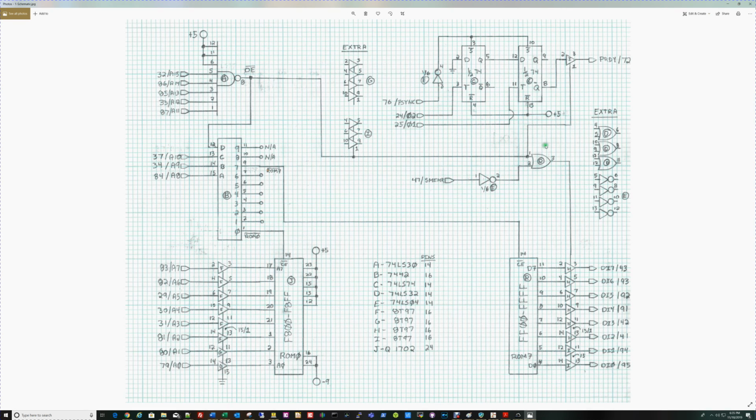We'll get these 2 pieces in place, and then it'll really be a matter of the huge amount of wire wrapping, which is all 8 of the 1702 sockets. Every pin on the 1702 that wasn't soldered to a power rail was just going to be wired in bus. Pin 2 to 2 to 2 to 2 to 2, 3 to 3 to 3 to 3 to 3. The only pin that'll be unique is pin 14. Those are the chip enables.